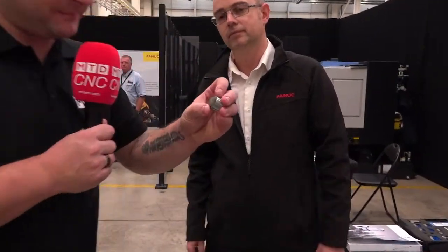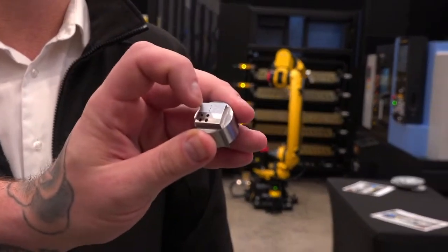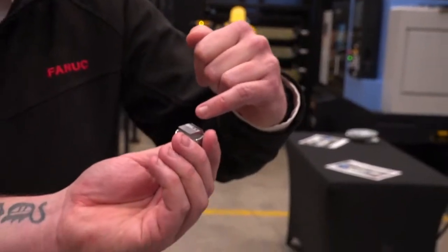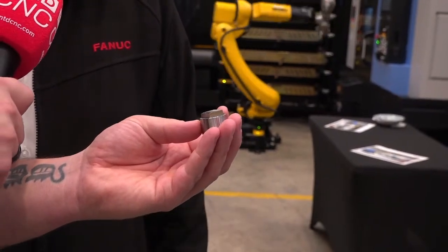We see the top. So if, Liam, I don't know if you can get that, but you can just see it. It actually looks like you've got specks of dust on your part, which is just the surface ground finish. We've lapped that one on there, and look how bad the lapped part looks on the screen. It just shows up the inconsistency of the surface finish.